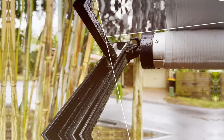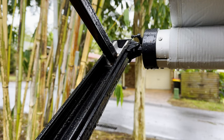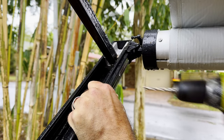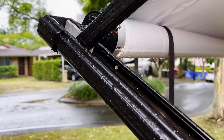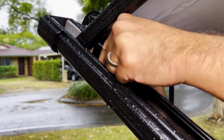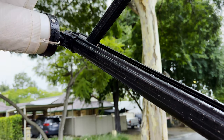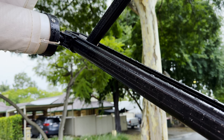I've marked it out 90mm from this point down to 90mm there — let's drill that first point. There we go, perfect. Now let's put the eye bolt in. I've gone with a stainless steel washer on the eye bolt so that it will spread the load when it's pressed up against it. Let's put the other washer on — there we go, tight like a tiger. Now it's time to do the other side. Let's double check the measurement: 90mm. I've marked out a line there, so let's get to the drilling.